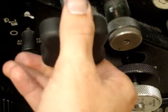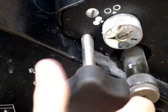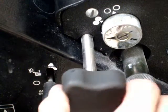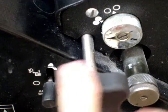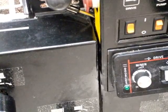And you don't have to turn these too much. Basically what I go by is half turns, quarter turns on the press. And so what you're looking at here is quarter turns. If we go from one extreme to another, we get about 14 quarter turns. And so I usually just start out right in the middle. So now we're at the other end, so I go 1, 2, 3, 4, 5, about 6 or 7 turns is right in the middle. And now once we start printing, I'll know either to go left or right, and that will tell me clockwise or counterclockwise.